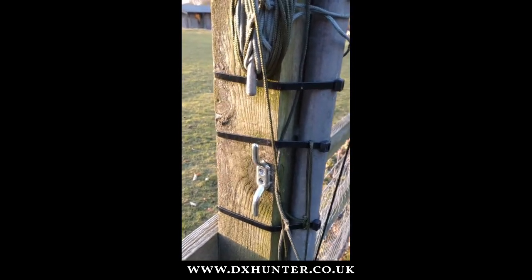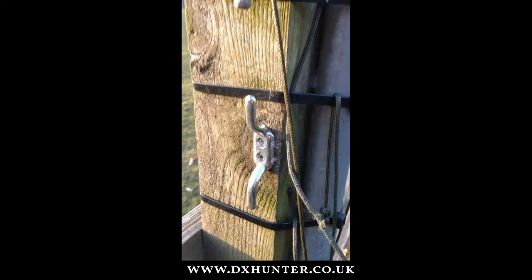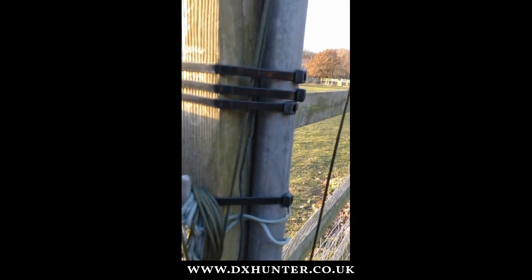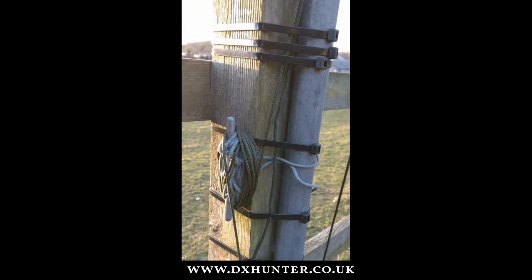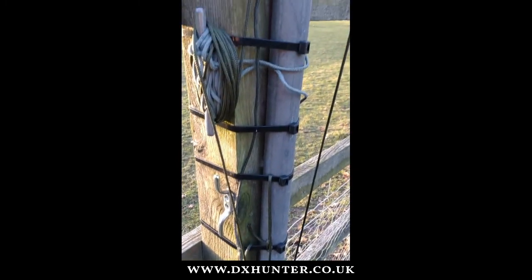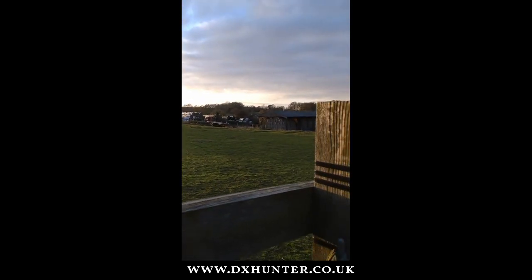This is how I secure my antennas here, as you can see. That's the linen line cleat — I think they're called that — but they're actually ideal for securing antennas, so that's what I use here. The pole is secured with large tie wraps. The reason I've done that is so that in case there's a mega wind, I can quickly drop the pole if need be. And as you can see here at the QTH, it's a beautiful day here in Suffolk on the east coast.